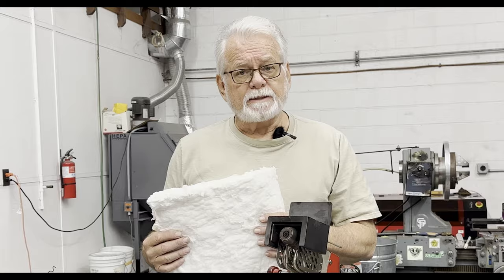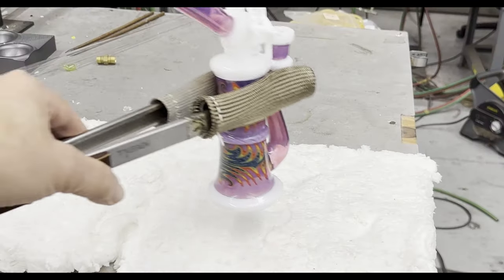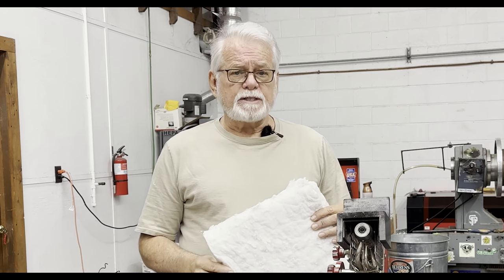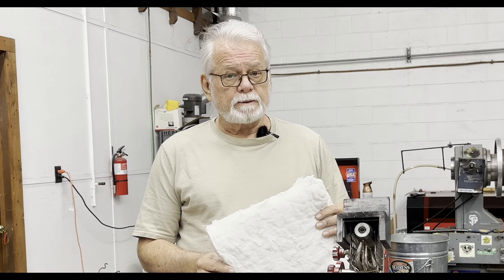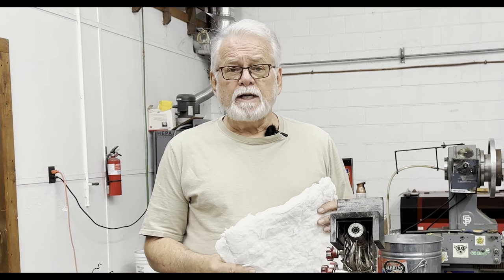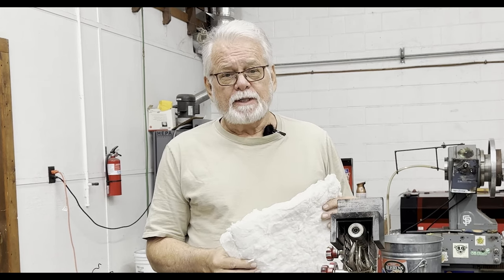This next tip is strictly old school. It was in common use in glass studios for many years, but it pretty much gets overlooked these days. I'm talking about ceramic fiber blanket. I always have small pieces of fiber blanket around — I use them for many purposes: to slow cool a piece I am crashing, to set a hot piece on so it's not shocked by the cold bench top, or even to stuff open holes so I can get air pressure while working on a piece. Fiber blanket is cheap and easy to find, but traditional fiber blanket has asbestos in it — and that is a big no-no. Aero Springs has sold a non-toxic fiber blanket for many years that's comparable in price and works just as well. This stuff is so non-toxic you can actually eat it — but I don't recommend you do that. I do recommend having a few sheets around the studio. There's a link to Aero Springs in the description.